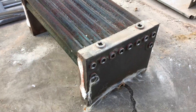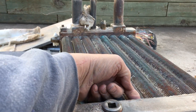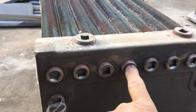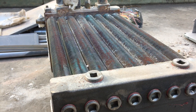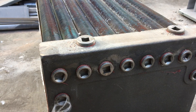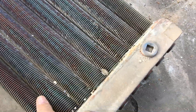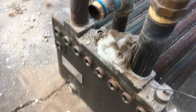The headers on each end are cast iron. Through the openings under these plugs, they insert the copper, and then a tool goes in this end and actually expands and rolls the copper. The seal is made simply by expanding that copper into the cast iron header — I don't believe there's any type of weld or soldering that actually makes that connection.